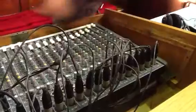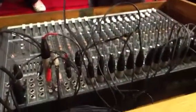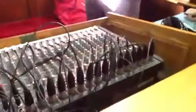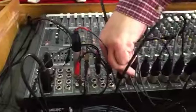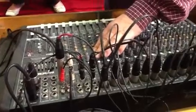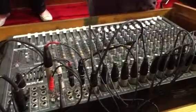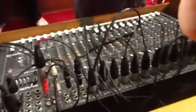What I've introduced here is what's called foldback talkback. I'm using a spare channel, and from here you can talk to the foldback speakers — so you can actually talk to people on stage. I just plug that mic into that channel there and send its signal to the foldback. That's talking to the foldback now. You can set it up so it only goes to the foldback speakers — that's all it's doing. It's basically a spare channel.